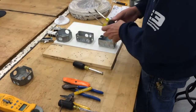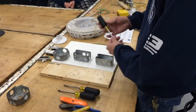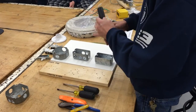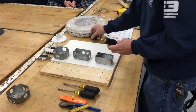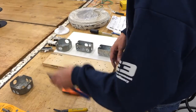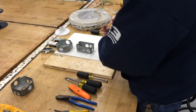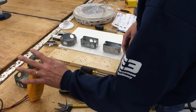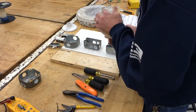The tools you're going to need: a Phillips and a flat screwdriver. You can get a quarter-inch nut driver, but I'd prefer everybody to use the 5/16 screws so they're all the same — if you have a couple different screws you've got to figure out what tool is what. You're also going to need wire strippers, diagonal cutters, an electrical knife, linemen's pliers, and a crimping tool for the solderless terminals. Eventually you'll be using the meter. You'll also need wire nuts in different sizes and colors.